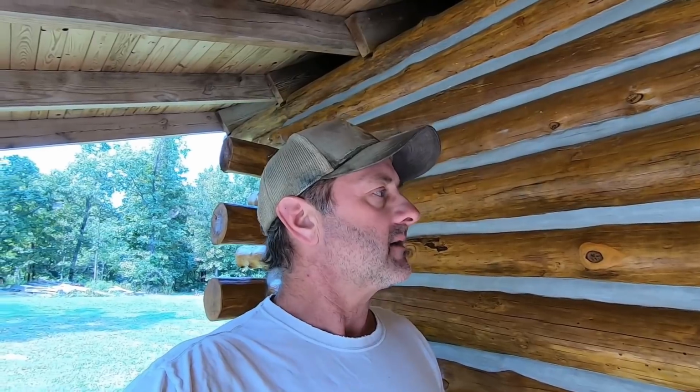Also, we started off using the insulation from Home Depot, and it was horrible. We used mineral wool insulation in between the logs, and you can't really fold it. What we were trying to do is fold it so that as the logs shrink, when we heat the house up through the first season, it'll expand with it. They're kind of under compression because we really packed that stuff in there. And it was really hard to fold the stuff. So we went to Menards and got some insulation there. Same type of stuff, different brand, and it folds like a dream, almost like a piece of foam rubber. So we ended up getting some stuff from one place and some from another.